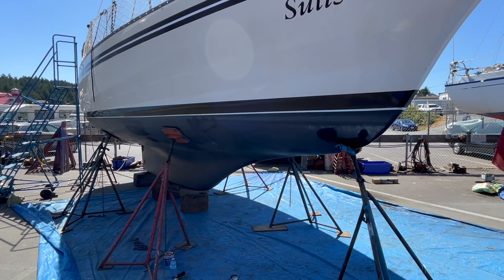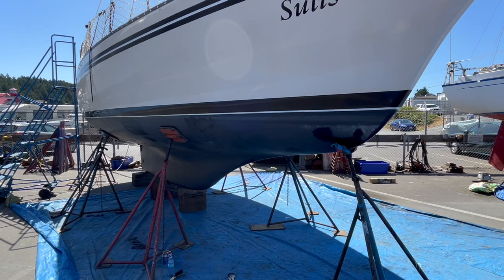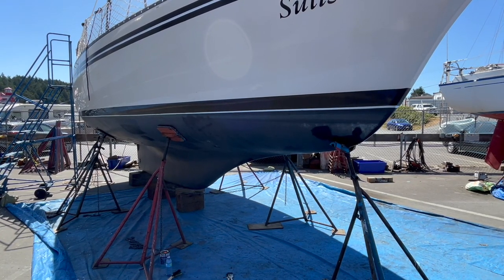This style of hull here is known as a long keel with a cutaway forefoot. What defines a long keel? Essentially, a long keel boat follows a straighter course. There is more wetted surface, so it's not as much of a performance boat, especially in the upwind situation. On the flip side, you have the option of a longer, straighter, more solidified course line, as well as greater comfort.